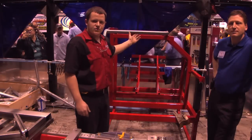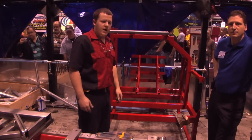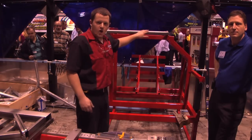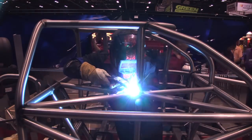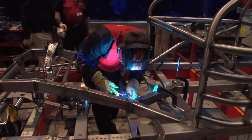This material thickness right here is 090 thousandths wall, mild steel — it's DOM, strong, and also polished on the outside surface. Rodney's going to be MIG welding the center section and the main chassis itself with the Miller-Matic 211.